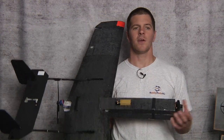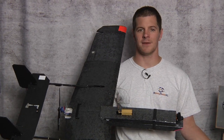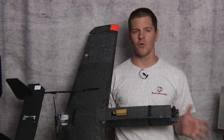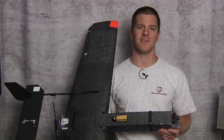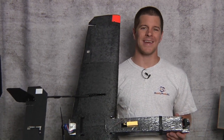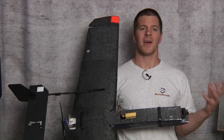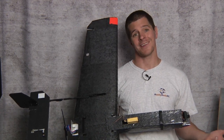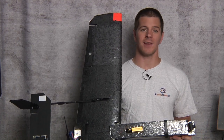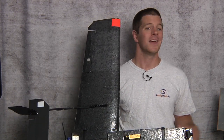The first thing to consider is the camera. Which camera should you choose? It's up to you. They come in various different flavors, from 420 lines all the way up to around 700 TV lines. Your goggles' resolution is usually around 480 to 550 TV lines, so anything greater than 600 TVL, you're not going to see any difference in your goggles. This is a 600 TV line camera because I like crystal clear video. But that doesn't mean a 400 or 480 TV line camera is no good — those are excellent. I flew with them for years. They're a lot less expensive and they do great.